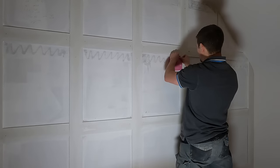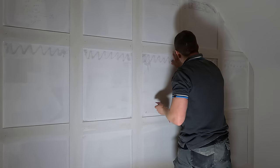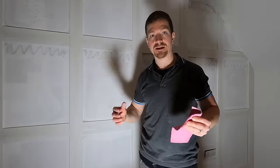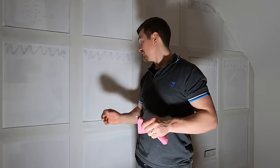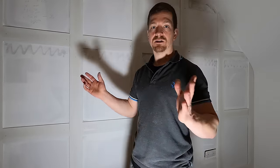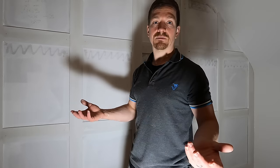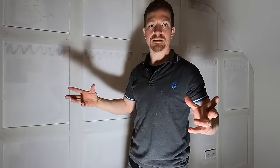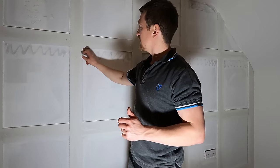With your finger take most of it out. Try and follow it all the way around — it's the corners that are tricky. I usually like to use a J-cloth or a dishcloth, but I've got these little sponges. Get the corner, get it in there, and sponge it out. That means you can get into your tight corners rather than just trying to get your fingers in there — make the sponge do the work. The biggest labour in this is going to be the filling and the painting — it does take a lot of prep to get this right.